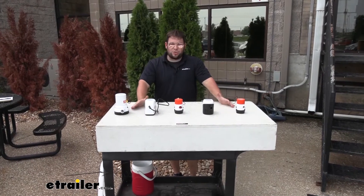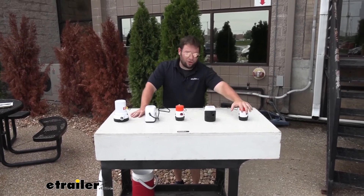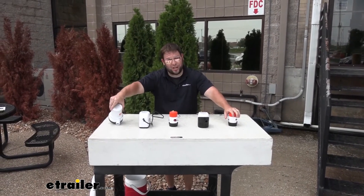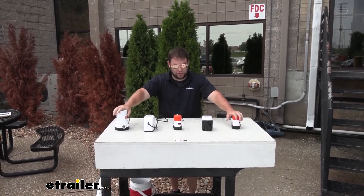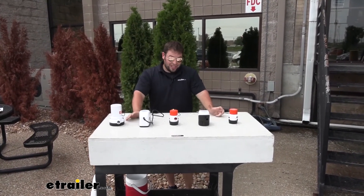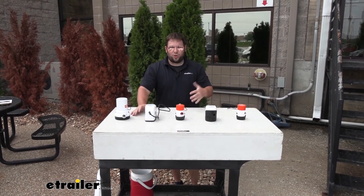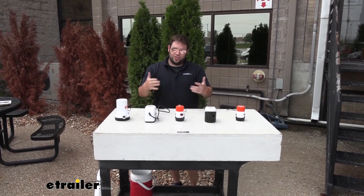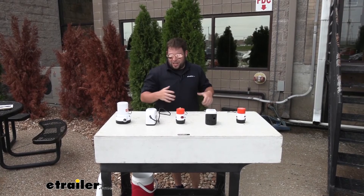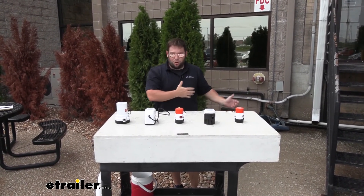So that's pretty cool to see them right in a row — they actually do make a big difference. They don't just have the numbers on there for no reason. Our lowest one, the 500, was 50 seconds, and the highest one at 2,000 was 22 seconds. That's a big difference, and we saw that change with each one we used. One thing I will note though is the sound sure didn't change too much — they sounded about the same, especially when submerged in water. It gets noisier when there's no water, right before it shuts off. But most of these are going to be tucked away somewhere in your boat, not right in front of the steering wheel in your face.